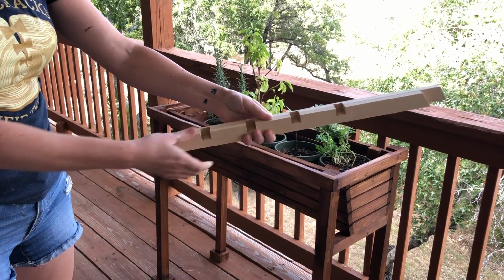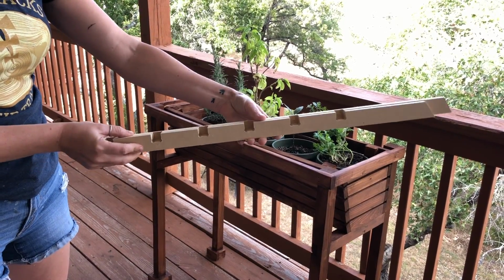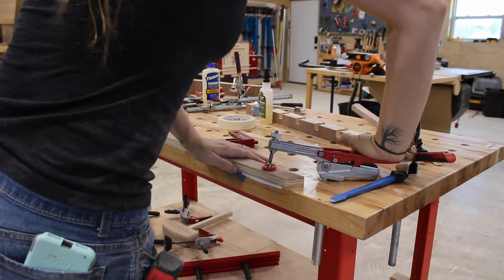This way, whenever the two are glued together and the seat slat is inserted, it has a strong joint but looks seamless from the outside. I just made the inside part, so now to make the outside part.